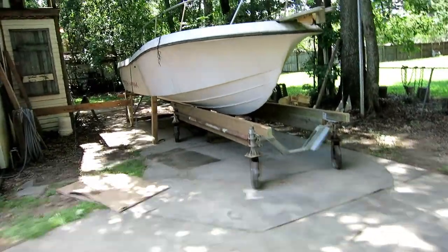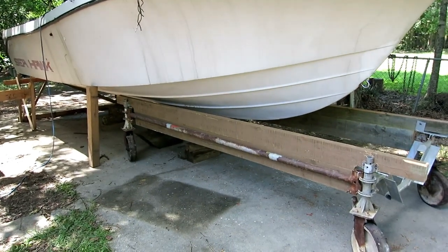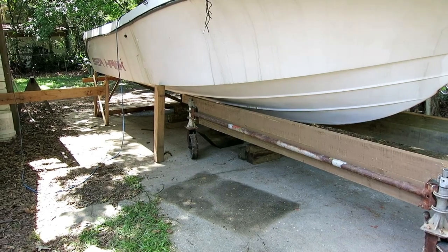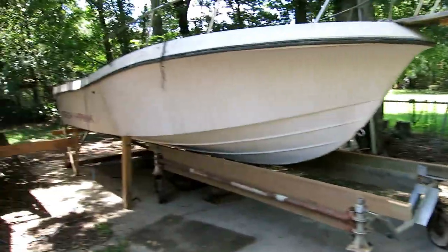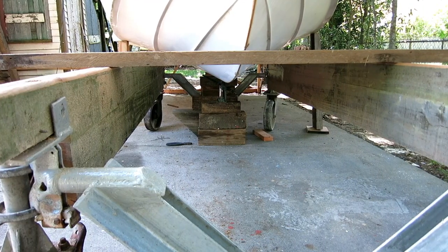That's as far as I can go until I move a pile of blocks, but at least there's something under it now. I'm going to start the reverse process of moving the blocks, but the dolly only has one cross member whereas the trailer had five that I had to work around, so this is going to be much quicker. I took the weight off the stack of blocks with the hydraulic jack and another stack, moved the original stack to the other side of the cross member, so now the dolly is free to roll backwards.